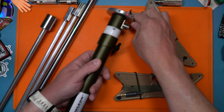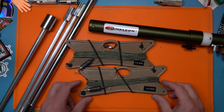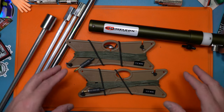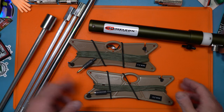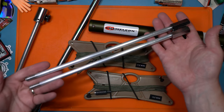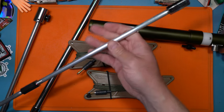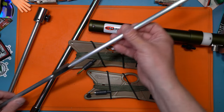This is a testing unit — they sent this to me to test, so some of these radials are already pre-cut. I have two different spools: I think I have four of each — 17.5 feet and 12.5 feet. They are modifying the manual and the instructions for how they want you to utilize this antenna, and it's going to change which radial wire lengths you might use. They also included something else — I didn't expect this. I think this obviously adds vertical length to the antenna. You add this to the top of the coil, and then add the whip on top of this.